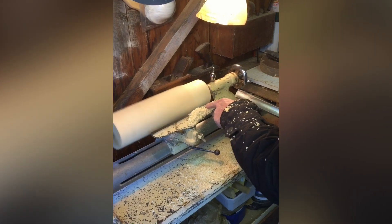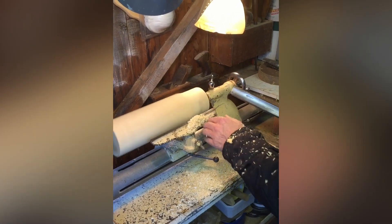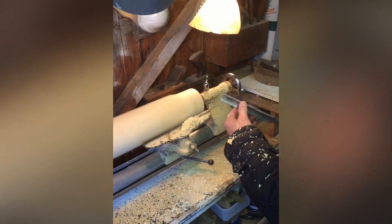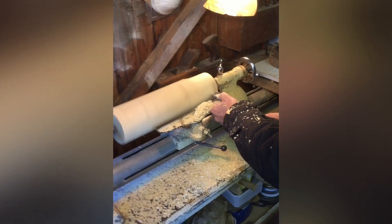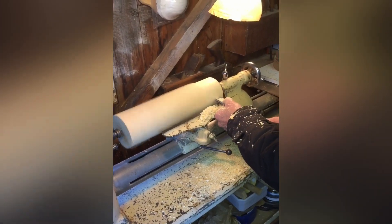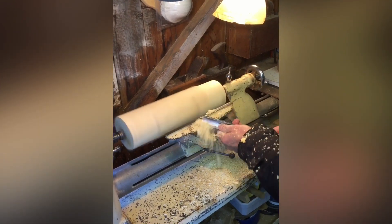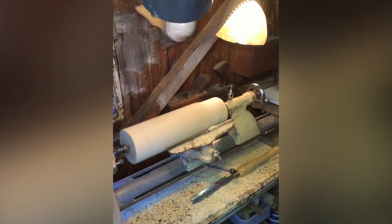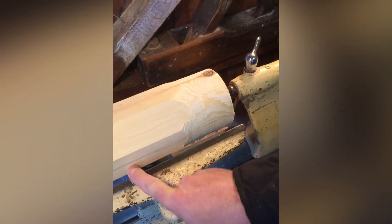After a while the gap has obviously increased because the diameter reduces, and the tool post at some point will need to be moved towards the timber spinning. That's the first stage — and you can see you've got the beginnings of the shape. We'll eventually have that shape all the way through, which my son will do in a moment and we'll come back to you.